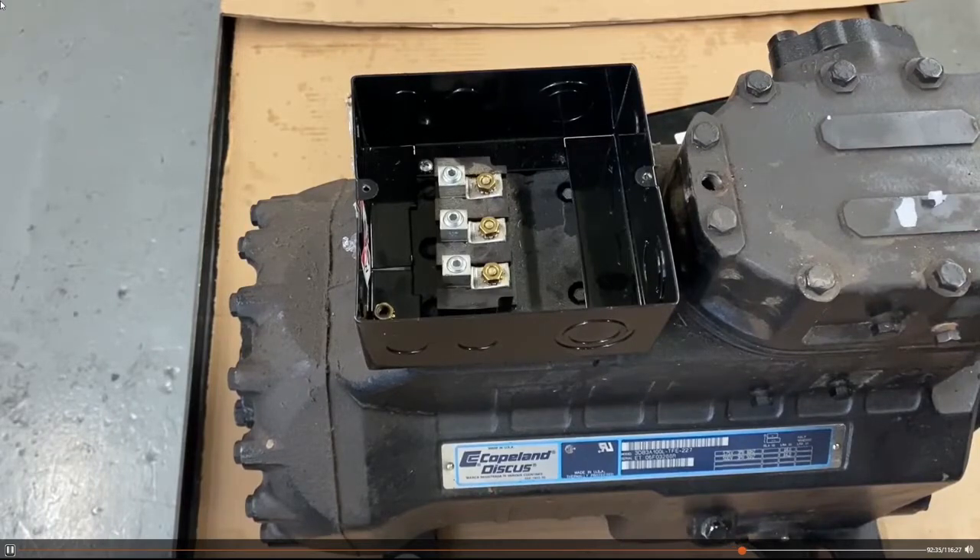The reason we're doing that is to get the electrics, the winding resistance, because the first step in tearing down a compressor is checking the electrics. As mentioned earlier in the training, not many mechanics are tearing down semi-hermetics anymore. They're not even taking off the heads, and that's what we want the guys to do — at least take off the heads and the oil pumps to check the compressor so they can find out most of the problems.